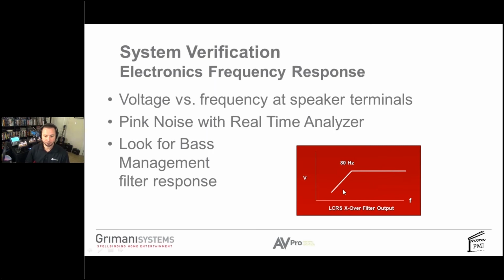So what do you do? Well, you could change the wire. But let's say you're there for just 2 days and you can't change the speaker wire. You're not allowed to do that. Well, at least you can start off with the equalization process here and dial in an EQ to correct for that electrical response. It's not fixing everything because you still have too much resistance between the amplifier and the speaker, so the control of the speaker is not going to be very good. But at least you're starting off with something that's got the right response. And does this happen often? Yes, it happens often. Wow.